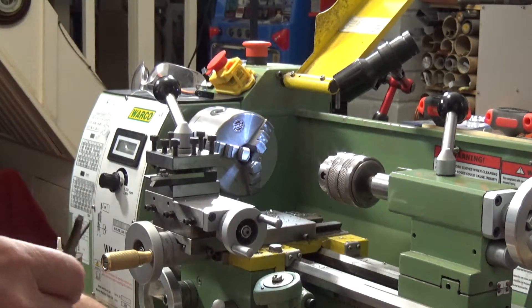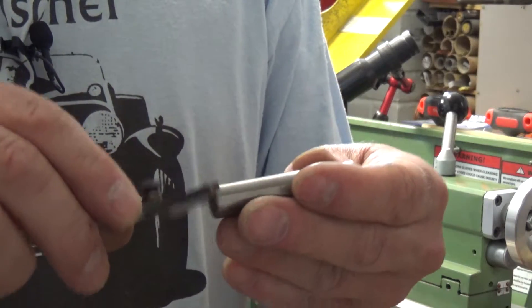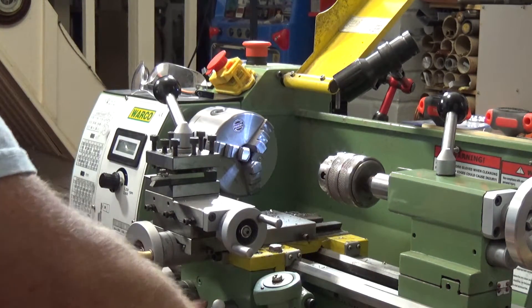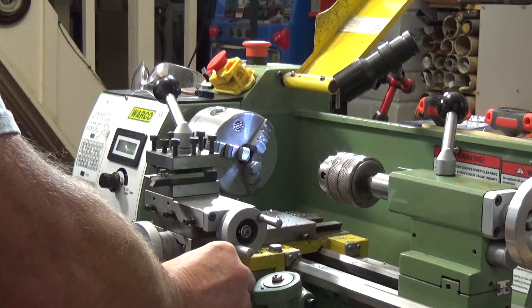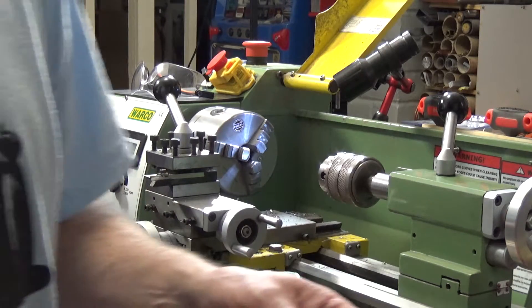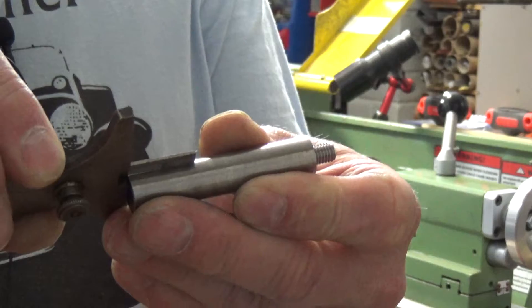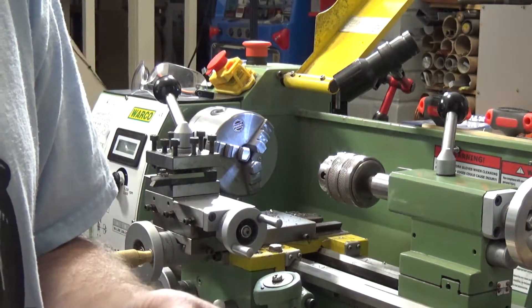And then we can mark on the other end of our metal rod where — how deep we want the thread to go. Now first of all I need to work out whether that's going to be too long as it is, but I don't think so. That's probably going to be about right once the ball's on there. I don't want this handle to be any longer — it's long enough, but it's just much nicer to use with the ball on the end of it. So we'll go with this piece and I'll cut the thread on the other end. I'm going to do that off camera because you've already seen me do this end and it's exactly the same process, and then we'll come back when the handle's done.